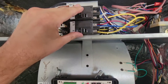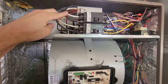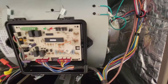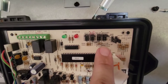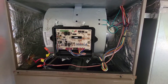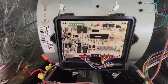This right here is the heater kit — I've got a 50 and a 40. We've got number six wire for both of those breakers, so we've got plenty of wire. There's our motor. We've got heat pump and AC settings: heat, cool, delay, and adjust. I usually put delay on B, but you don't really have to mess with this — you're going to set everything on your HX thermostat.